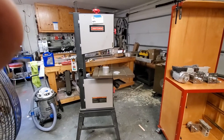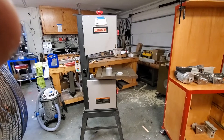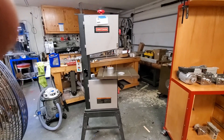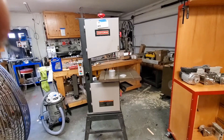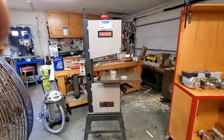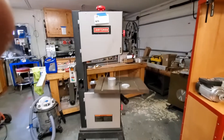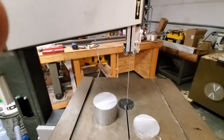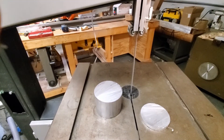Today we're going to do an upgrade on this wood saw. It originally had a fixed single-speed induction motor. We're going to swap out that motor with two different variable speed servo motors. It will turn this saw from a wood-only saw into a saw that's capable of cutting metal — as large as this piece that was just cut recently, or even larger.